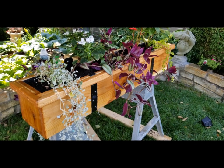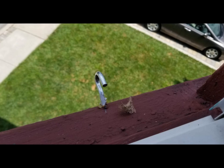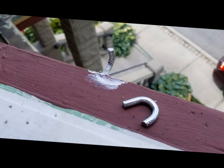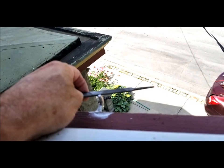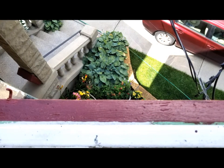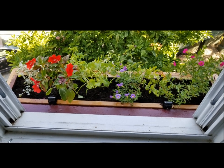The plants are in and then up on the windows — they just hang on two hooks. These hooks I've cut down to size and bent just so they'll fit in those hangers. I also use an elastomeric caulk to keep water from getting into the rounded steel, and once you cut those off you have a sharp edge — use a file to round it off so nobody gets cut. So you've got these two little hooks, small as necessary to hold the box. Paint them too, because they will rust.